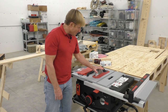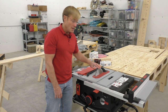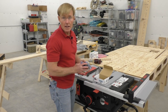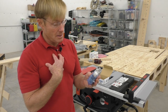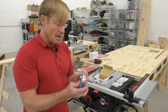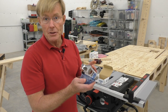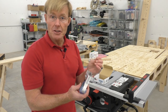As you know from the marketing of SawStop, their niche in the market is to create a saw that's safer to use if your body ever comes into contact with the blade. It has a mechanism — you can see this demonstrated online using a hot dog. There's a mechanism inside and, in my interpretation, it's electronic and it detects the current when your skin comes in contact with the blade. It basically jams a block of aluminum up into the blade and stops it instantly. In the demonstration I've seen, it barely nicks the skin of the hot dog.